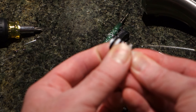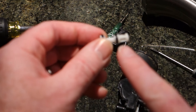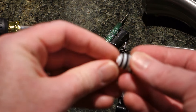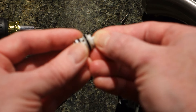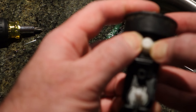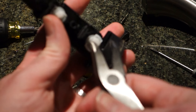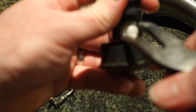That O-ring inside got some lube. We'll do it to the other one now. I'm going to go ahead and put this guy back in. This little hole at the end has to line up with the rest of the unit — otherwise it seems like it won't push through fully. It must be keyed somehow. Let's go ahead and put that guy back in, push down to the hole, push to make sure it's seated correctly. Then get my pliers again. And then just torque it back around until it locks into place, like so.